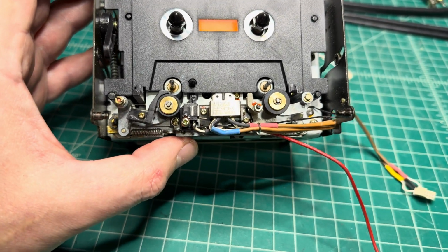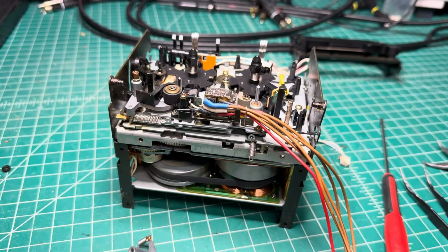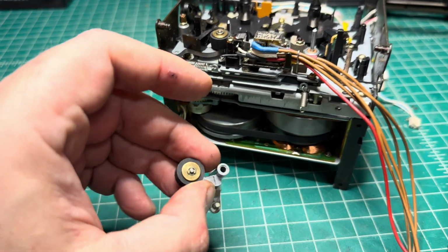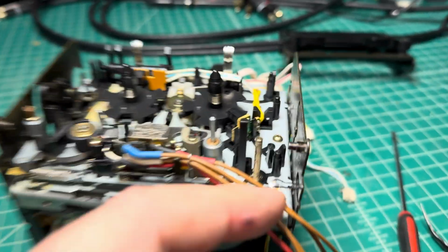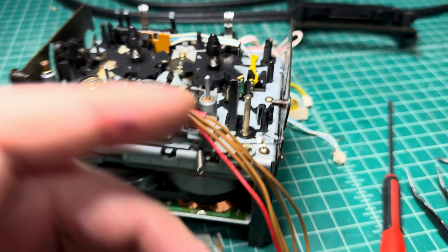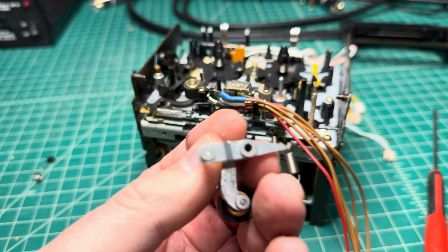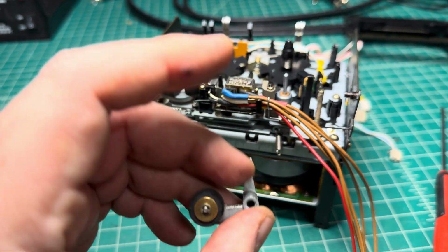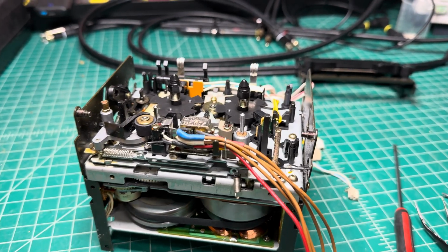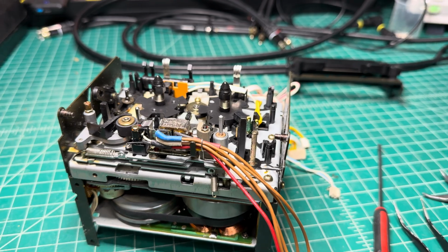And this will be time to assemble and check how everything will perform now. See you soon. Guys, while I was checking everything manually, I found another issue. It's famous lubricant, which is on this shaft with the right pinch roller arm. I spent some time removing it to clean up and lubricate because it was barely moving. All right. Make sure you check it when you disassemble your decks.